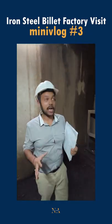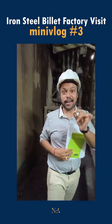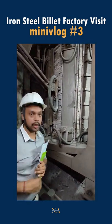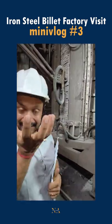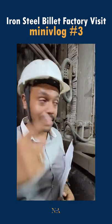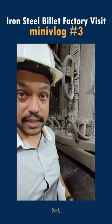Right now this is not functioning, but we were at a spot where there was molten hot iron as well. You see all those white rods? Those are copper rods filled with a certain material. Inside, the iron is placed, electricity is provided to heat it up and melt it. That molten iron is then cast into certain shapes — especially billets.